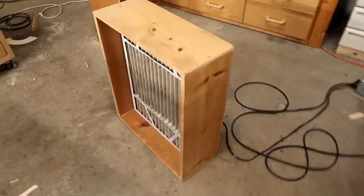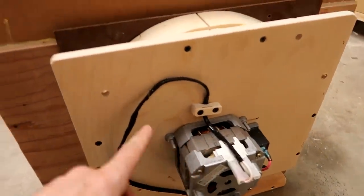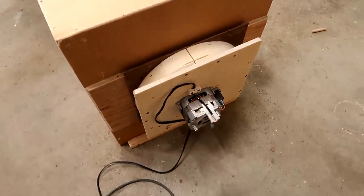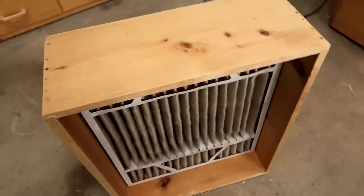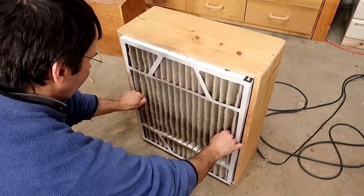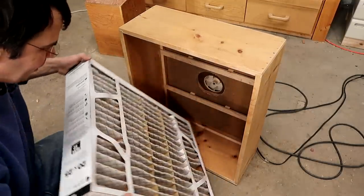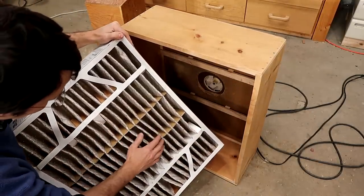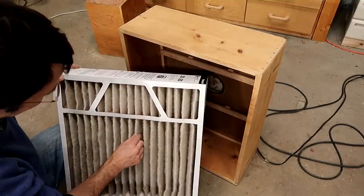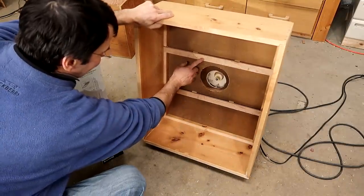I've also started working on a dust collector for this belt sander. This uses a dishwasher motor with a homemade blower — I made that a year ago when I was making some other videos about blowers. The filter is a furnace filter, which is really not designed for this sort of thing. My blower can do at least ten times as much suction as a furnace blower can do, so I've had to do some reinforcing. I added these things in here to prevent them from collapsing onto themselves if there's more pressure, and I've also got these pieces in here which help support the filter against the suction.